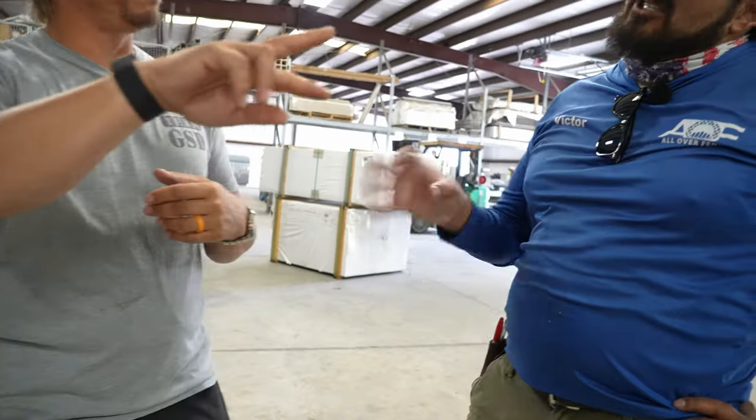How wide do you go before you put a wheel on it? Six or seven feet, and only if we know there's a driveway — no driveway, no wheel. An experienced crew member like Cody or Pablo can build this gate from start to finish — welding and everything — in about 10 minutes, just one person. When you're really dialed in, you can do 12 to 14 small gates a day.